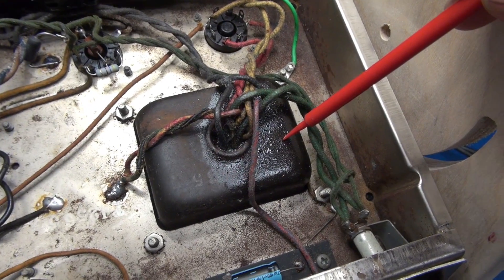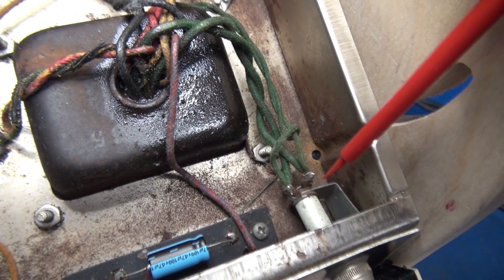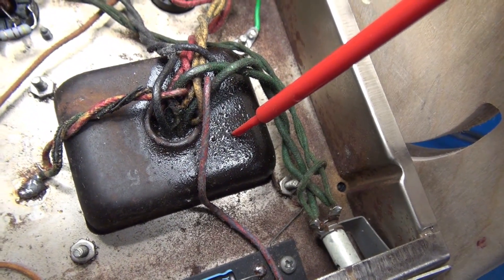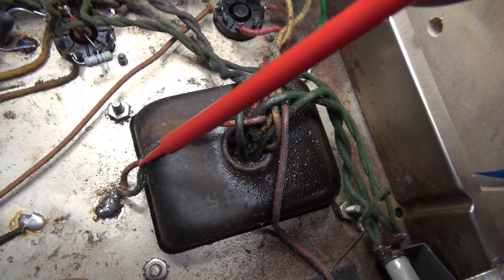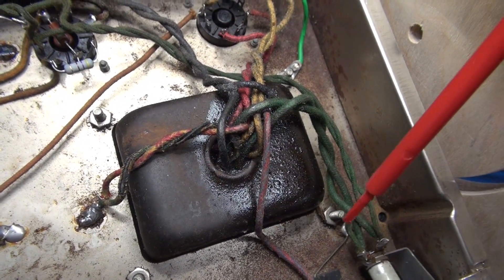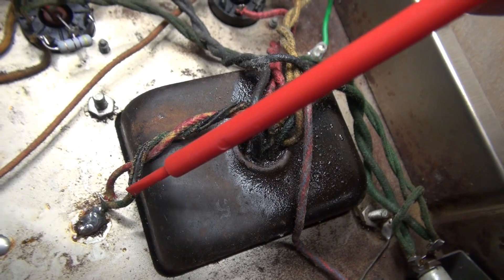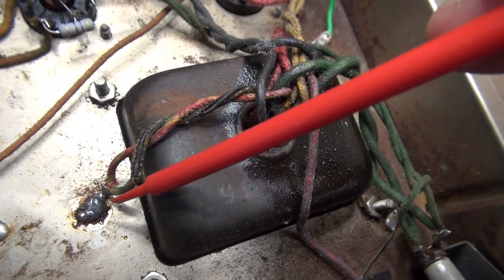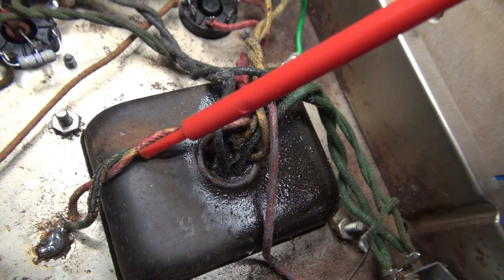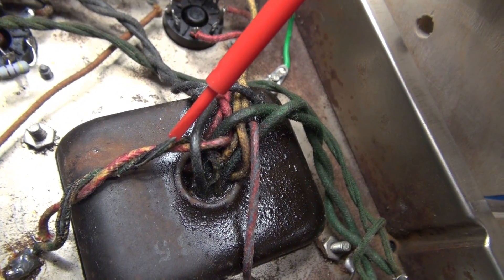Here's the main power transformer. On most of the models, you would see 200 ohm resistors coming off the lamp assembly to ground. But in this case, this transformer has the 6.3 volt center tap, so it does not need those balancing resistors. But take a good look at the center tap lead — it's soldered here, and there's a big burn mark in the wire.